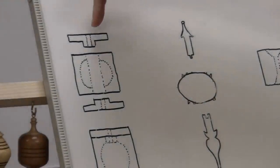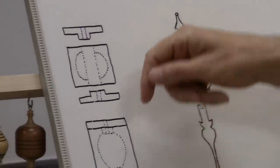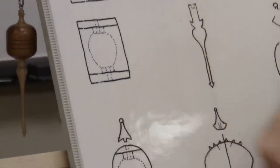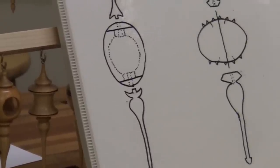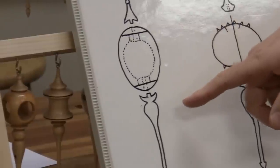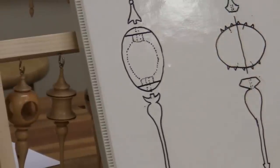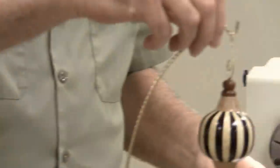A quarter-inch hole was drilled through it so you could put it on a pen mandrel. You get it all glued up, put it on a pen mandrel, then turn it to the shape you want. Then you have to make the finial — and the finial has to be an icicle to fit that particular body. This was pretty much an all-day project making just this one ornament.